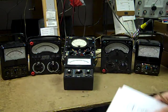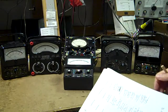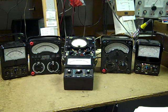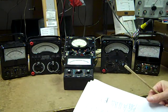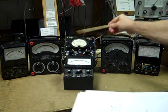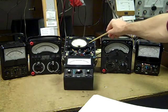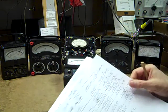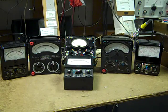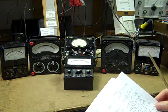The 6P — I was taking some readings on it the other day, wasn't altogether satisfied, so I did make some adjustments. Even still, its average for five ranges is 0.6%. That's quite good and certainly all you need for an analog multimeter. The PSM-37 didn't come out quite as accurate as I expected, but still its accuracy is 0.757% — still an excellent meter overall. Any one of these meters would serve your everyday purposes in a shop and exceed your requirements by a wide margin.